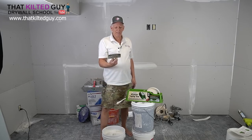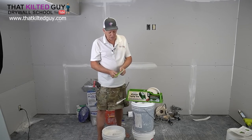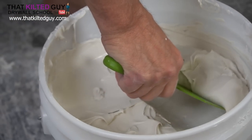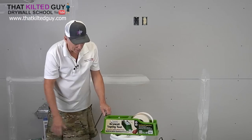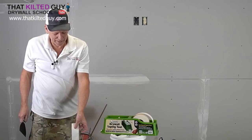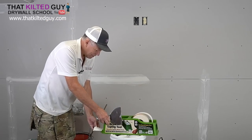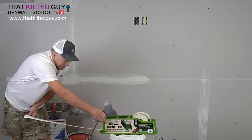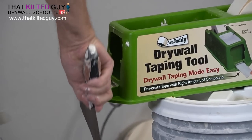This bucket scoop is really handy and feels really durable — it's got a little flex to it but basically fits the shape of the bucket. We scoop some mud out and as we wipe up, it cleans the bucket off pretty good. Pull out a little bit, cut that off, and you want to have a scrap bin so you can drop your trimmed pieces into it. For this butt joint I'm going to pull out roughly four feet — maybe a little bit more — then just cut it off.